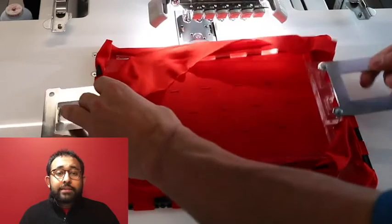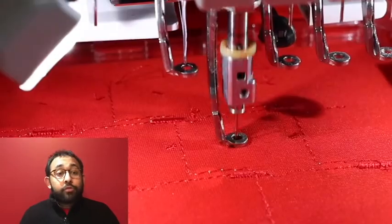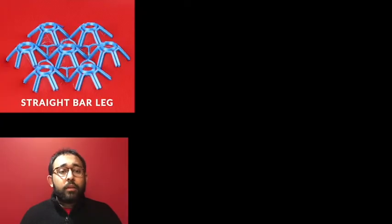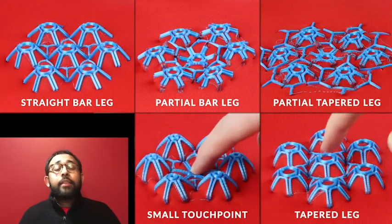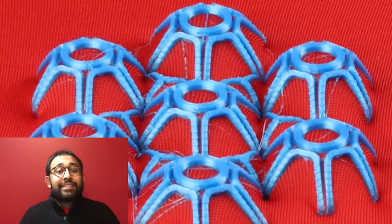Once both layers are processed, we align and combine the two frames to unify the two layers using embroidery. Finally, we crimp the coated copper wires onto the individual embroidered track outputs, allowing us to easily bunch and run the wires to the processor. With this fabrication method, we explored several design parameters like the length of the button legs, the number of button legs, and the depth of the press, and then identified the optimal design, which is a button in a 3D tapered structure.